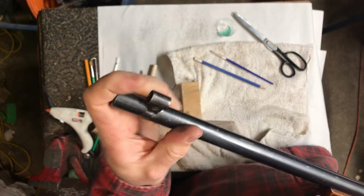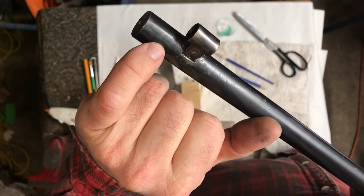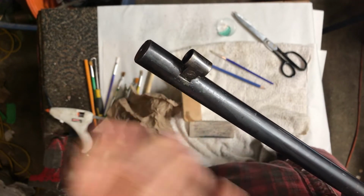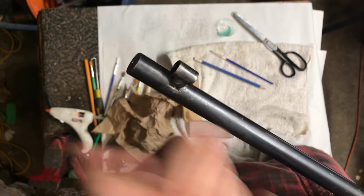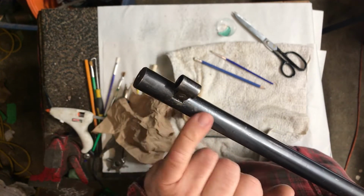And then once you get, like, hear me out here. I can't stress enough that there is a scratch there, but it looks like it's a scratch within the blue instead of in the white, which is the goal of this exercise. I don't want to blend that in so it disappears, because then I'm removing metal and original blue. I don't want to do that. I want to soften the edges a little bit with my eraser method and make it so it kind of is less obvious.